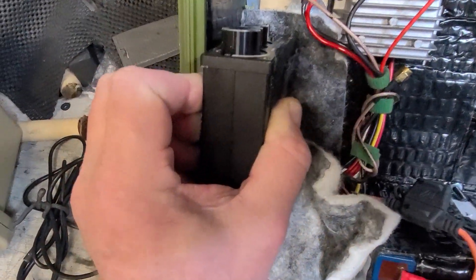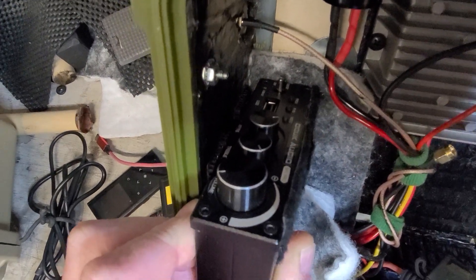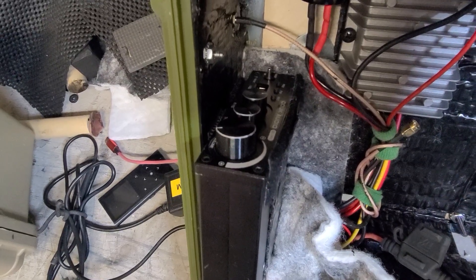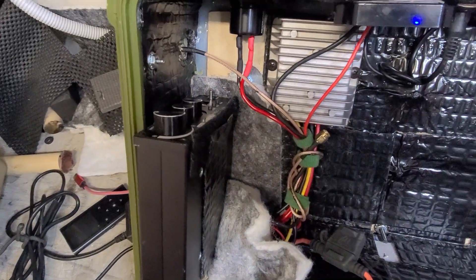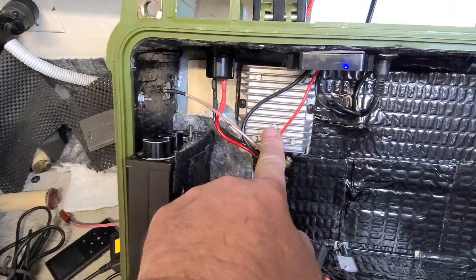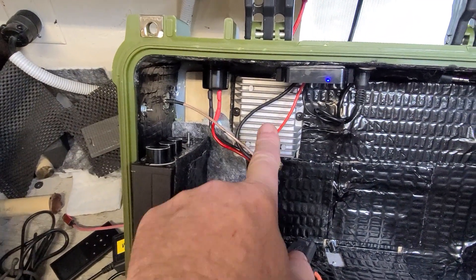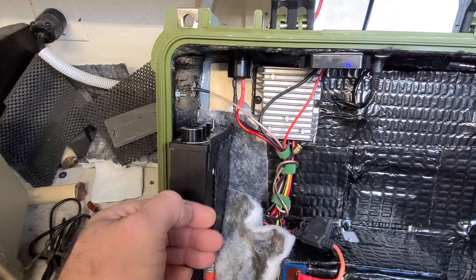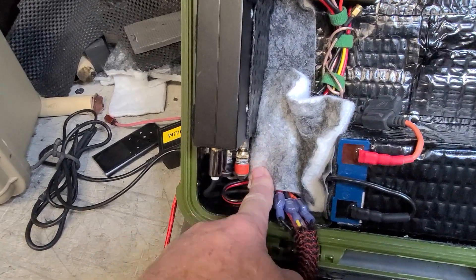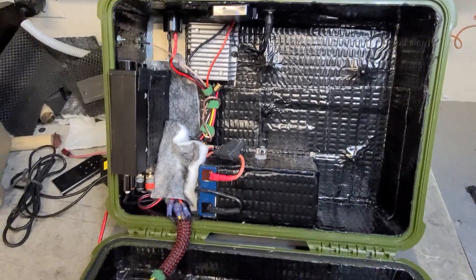The amplifier is a Dalk Audio — it's rated for like 150 watts per channel, probably good for about 75 to 80 watts per channel RMS. And what I'm doing is running it at 36 volts using a 12-volt to 36-volt step-up booster. You turn the switch on and off and it shuts just this and this off, so you get 36 volts of full power going into this amplifier for full boogie. Banana plug speaker connections. Weighs about 22 pounds.